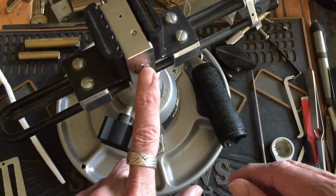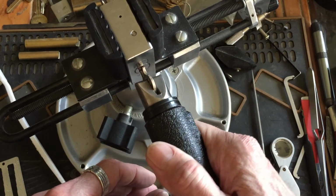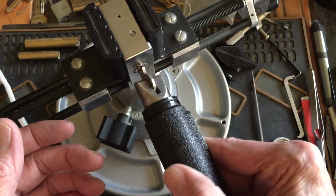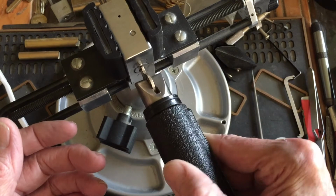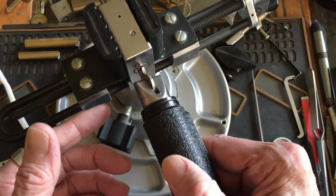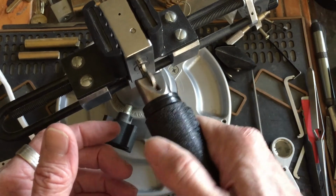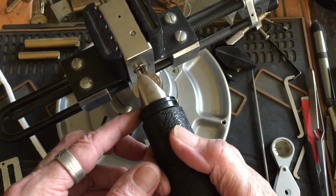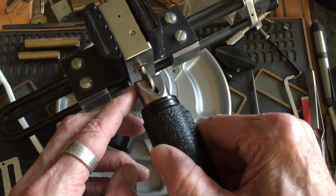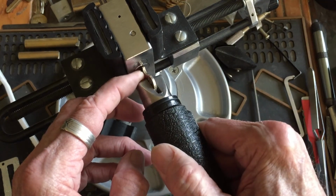I'm going to do a little refining on this, because if you hold it down, it doesn't turn, but if you pick it up, it turns fine. So the key's just a little off, so I have to figure out where that is. You can feel it, you know, and you had to push up to get it to open. So that means it's probably just a little binding on a front pin, but we'll work that out. Oh, I think I got it now. No, yeah, see, there's just a little bit there. You just lift up a little bit on it, so it's still a little low, not cut deep enough in the front for it to just go. Or maybe it's cut too deep. Yeah, I think it's cut too deep right here in the front. So I'll lighten that up when I make a key.